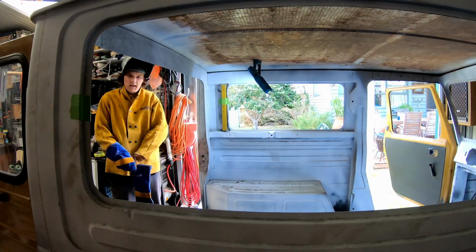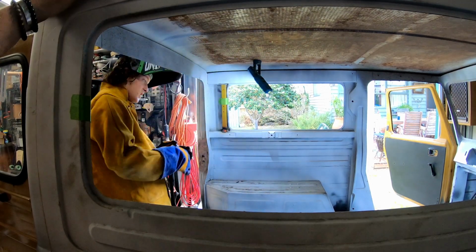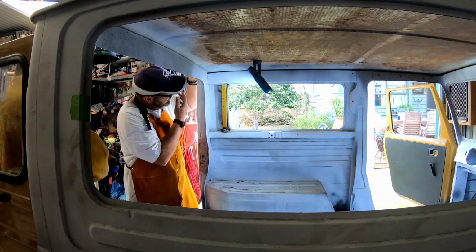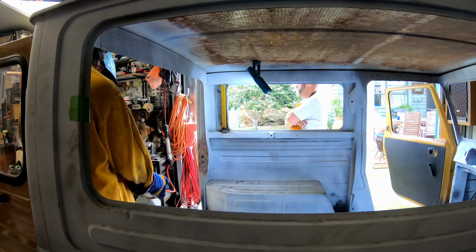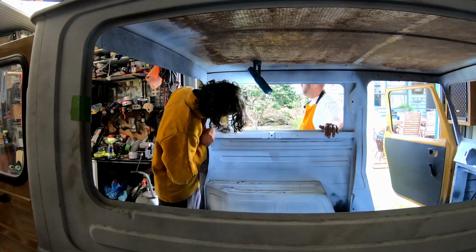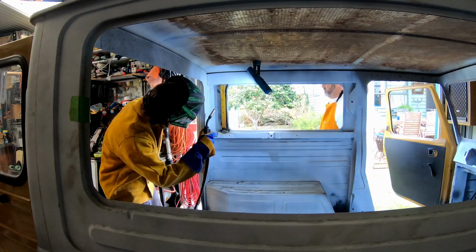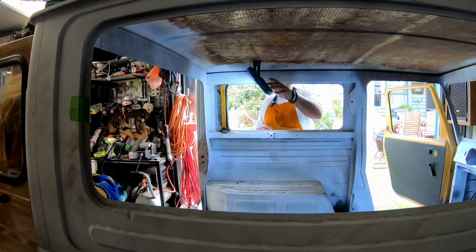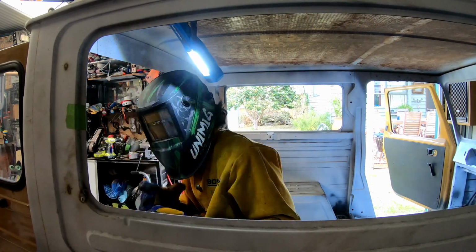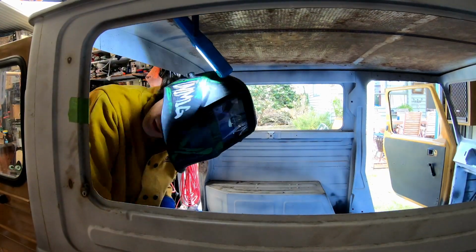So the welding party doesn't stop because there's more welding to do. There's kind of always more welding to do on this car, and here you can see us adding in these two support brackets. They were both cut out from the original body, and they are the supports for the pop-out windows. This body didn't have pop-out windows for some reason, why I don't know. All we did to do this was see where the original supports were tacked on the yellow body, these supports that you see now, and then just cut them out there and then re-tack them on and re-weld them onto this body. So we did that on both sides, and then we measured the window up next to that and made sure it all fit nice and spick and span.